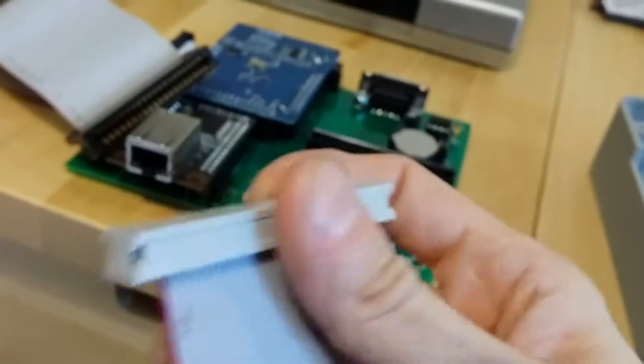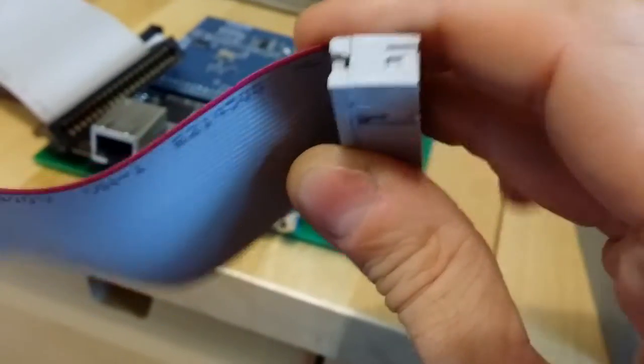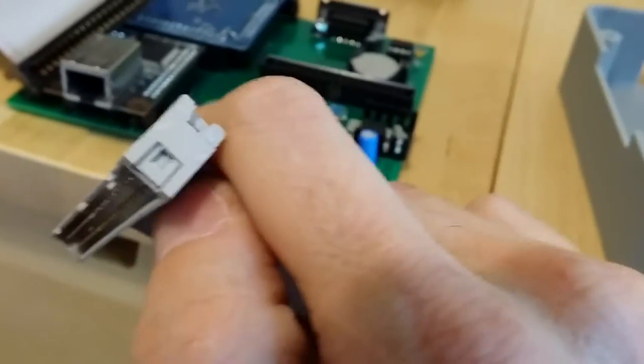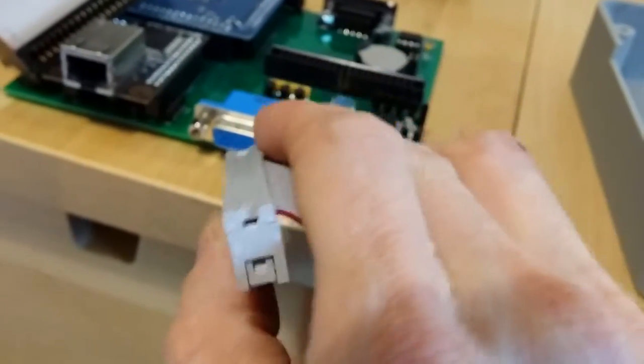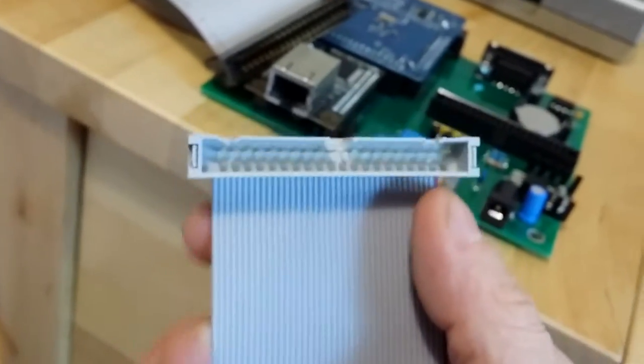And then the other thing is, sometimes if you get a cable from someone else, there's an optional extra strain relief clip that can go on these IDC connectors, where the cable is folded over and there's another piece of plastic over top. You can't have that. So if you get a cable and it has that, that extra strain relief part actually snaps off. You pry up on a part right about there and you can take off the strain relief and unfold the cable and have it like this. That's what you need to look for. And the link I provided, they do it the right way. Anywhere else, you're not really sure what you're going to get, even if there's a picture, because normally nobody cares, so it's not something they ever say in the description. So you really don't know what you're going to get until you get it.